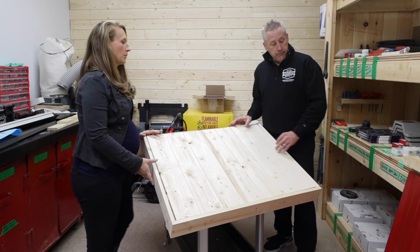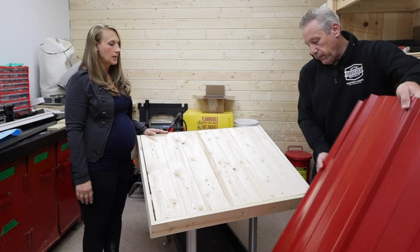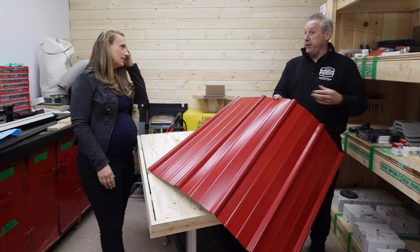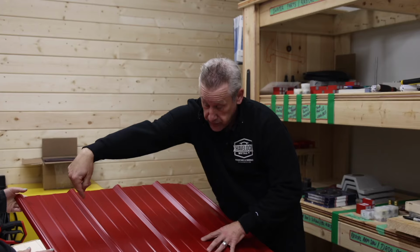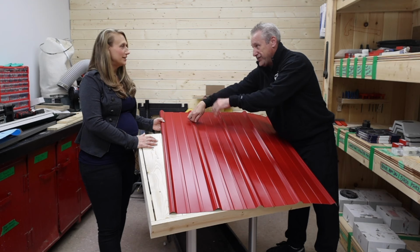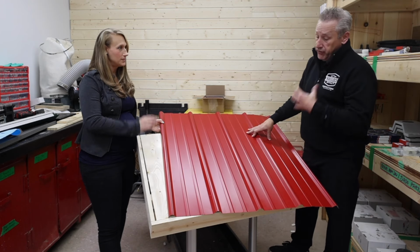A couple of install tricks is prep work. We recommend pre-drilling the panel on the ground, before you get on the roof. That's a good idea. When you're on a 9/12 pitch and you've got to reach in 3 feet to get to your panel, it's difficult to get that in there, and the fastener has to be punched in a little bit to hold in place. But if you're able to pre-drill on the ground, and we have videos on our website to do it, it's pretty straightforward.